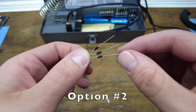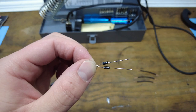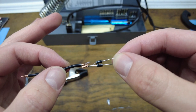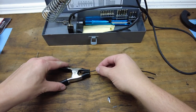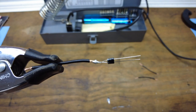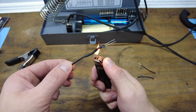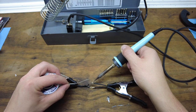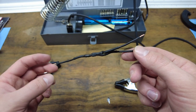If we were doing our 8-high mod, we would have our three diodes here twisted together with three separate wires coming off the ends. But we're going to be doing a 6-high mod, so we only need two diodes. We're going to twist these together on the butt ends with the negatives together, bend the ends with hooks, attach our wire lead, and solder them together. Now we can apply some heat shrink, attach our next two wire leads, solder, and add heat shrink. Then we add one more heat shrink over the top of the diodes and we're finished — we can always trim this to fit.